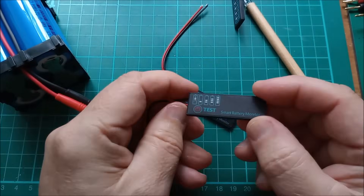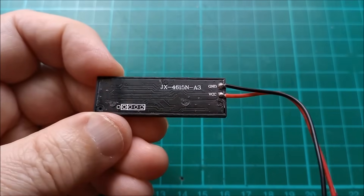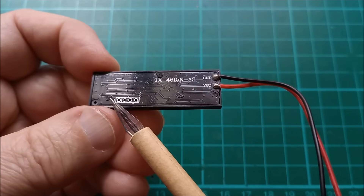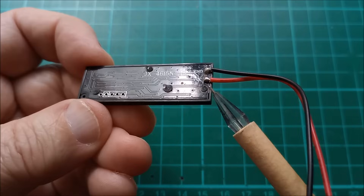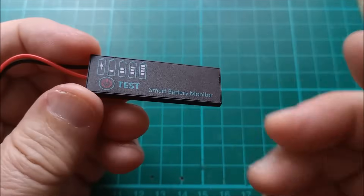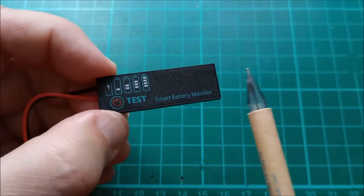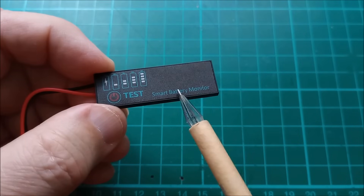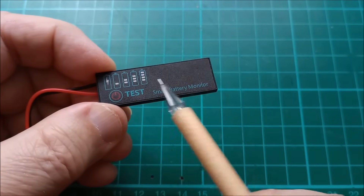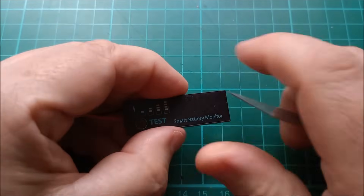Let's take this one apart — it's the same as the one on my battery. What it looks like is a circuit board on the bottom with JX4615N-A3 on it, a programming header for the microcontroller, and you can see where plastic pegs have been pushed through the circuit board and then a hot iron pushed over them — that just holds a plastic tray, this plastic surround, which presumably has little separators for the digits so they don't spill into each other's areas. Stuck over the top is just a plastic top with little transparent window areas for the LEDs. Let's peel off that plastic top.